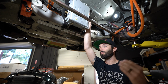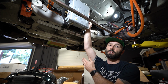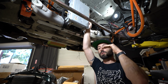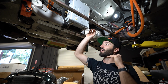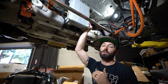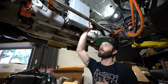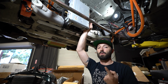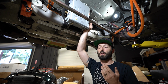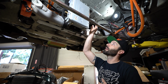Bottom balancing, on the reverse side of that, the battery management system again is in charge of that. So as you're driving your vehicle and you start hammering down, you're using up the pack voltage. As it gets to the bottom charge of those weaker cells, it's going to say, hey, drive unit, cut down on your amp usage of that battery pack so that your weaker cells don't get over discharged. That's keeping your batteries healthy, because that's how you're going to destroy your batteries and lose your charge capacity, by overcharging or over discharging your pack.